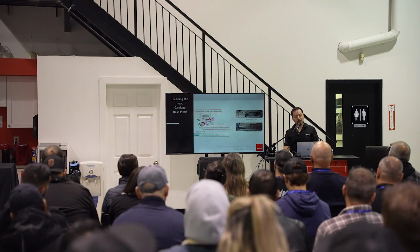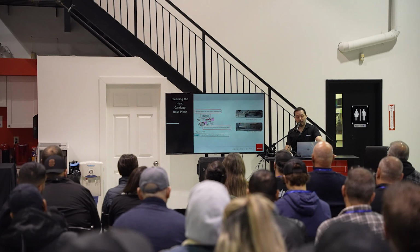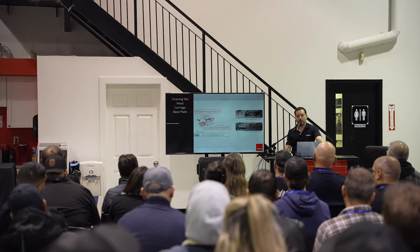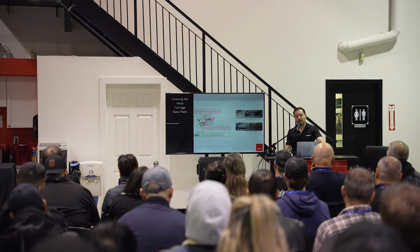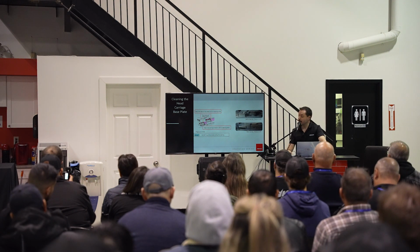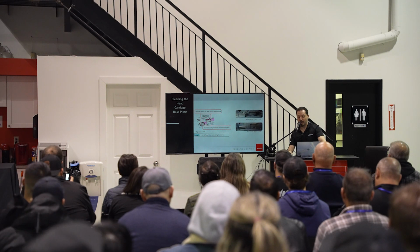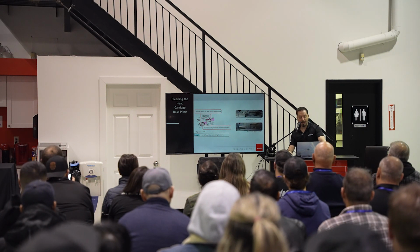It'll get really gummed up. It'll catch on the cap station and basically rip the sponges up and cause issues when you're printing. So you can see the difference between a dirty carriage and a clean carriage there.